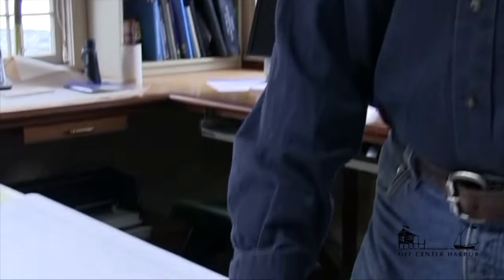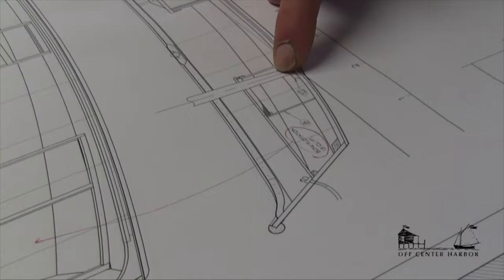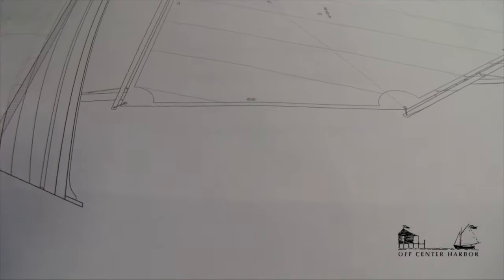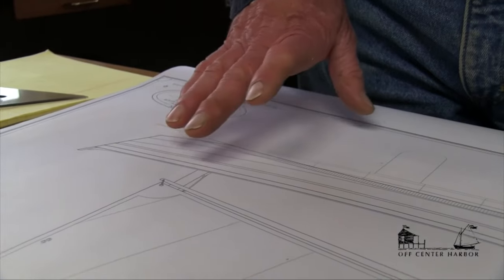She has a daggerboard that takes up a little bit less room than a centerboard. The mast steps through this forward seat compartment here. In designing a small boat rig — a dinghy rig like this — one of the most important things is that all the spars actually fit inside the boat where they can be properly stowed. That limits what rigs are available, and they tend to be, for boats like this, either a sprit rig or a lug rig. For this design I've used a balanced lug rig. The lug rig has the advantage that it's easy and quick to drop the sail. If a thunderstorm comes over the horizon and the wind picks up suddenly, you can stay low in the boat and get the sail down and under control easily without having to stand up.